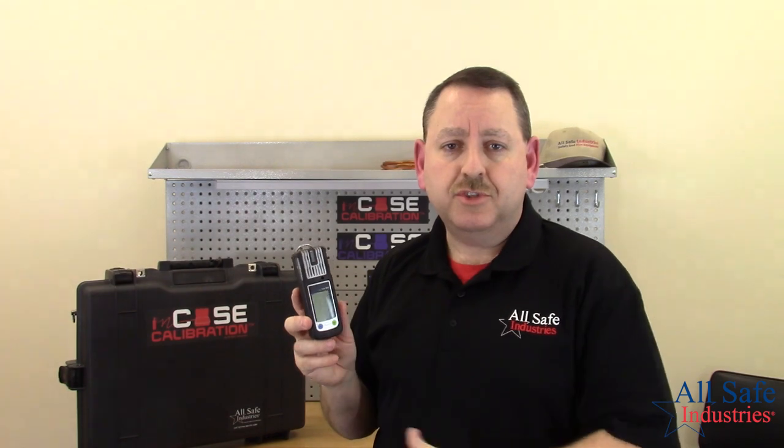I'm also going to talk to you about our kit that includes in-case calibration — it's the system for your gas detection instruments. We'll turn the meter on, push the buttons, go through the daily startup including fresh air calibration, a bump check, how to use the meter and the accessories inside your kit. We'll cover calibration and show you how to do that. Then I'll talk about maintenance on the unit — the sensors don't last forever, so eventually you'll need to change those. Finally, I'll cover a few other accessories you might want to use with your Draeger XAM2500.